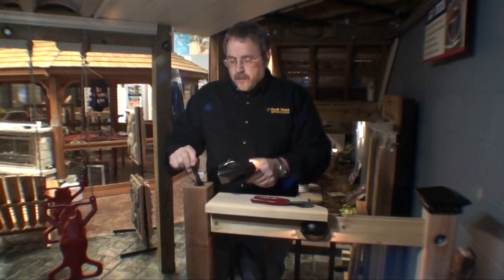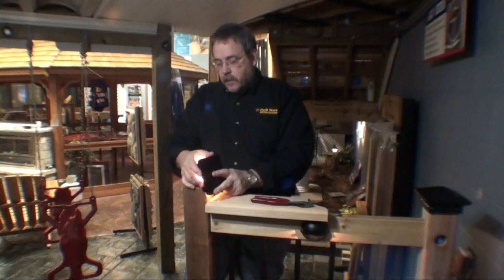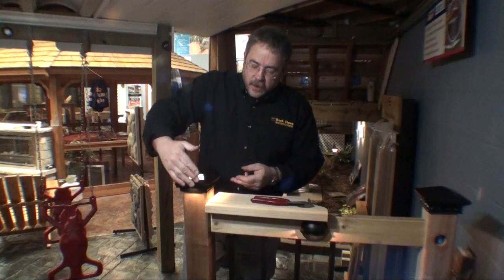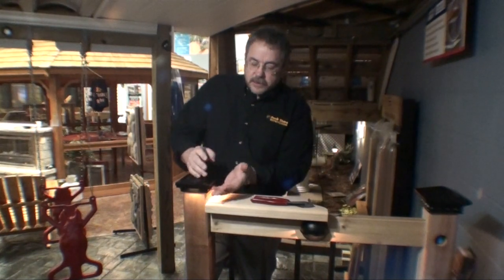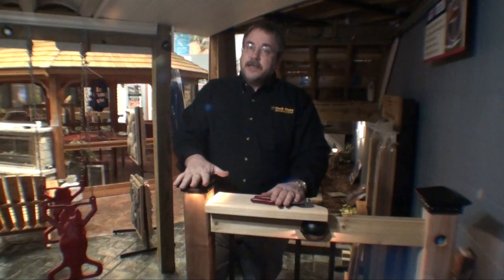Push them down into the post. We've left all this extra wire on and made a big enough hole in the post that we can place all that into it. We're going to assemble our cap, put it on top. And there you have it — notice that the lights are angled inward so it's going to illuminate all the sides of the post very nicely. If for some reason we didn't want the light on one side, we can simply remove that module or not light it. There you have it — it's as easy as that.